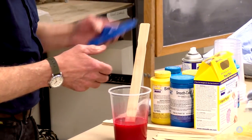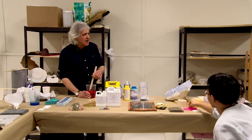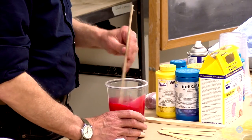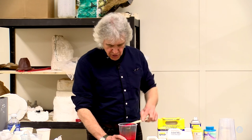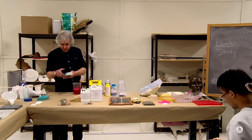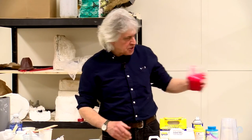Our little angel casting right now feels kind of like a gel - like a gummy angel. She'll harden up in another 15 or 20 minutes; it sometimes takes a little longer to cure completely hard and might be a little leathery. They do make resins nowadays that you can bend after the fact - specifically for architectural applications where you can cast it, let it cure, pull it out, hold it up to a curved surface, and nail or screw it into place.